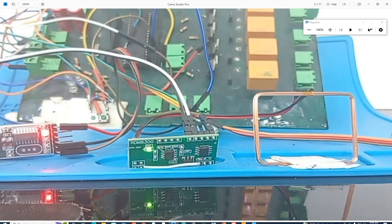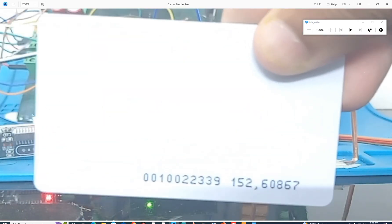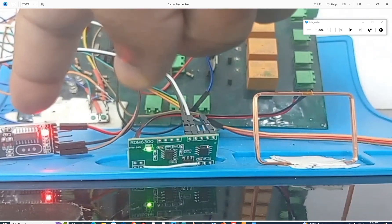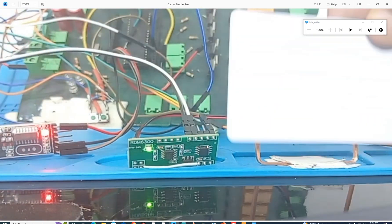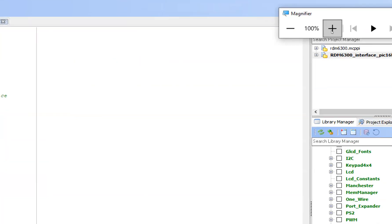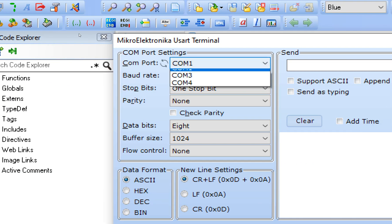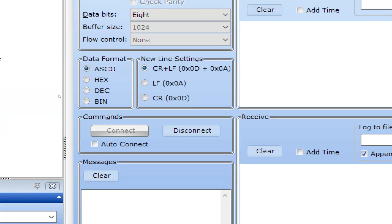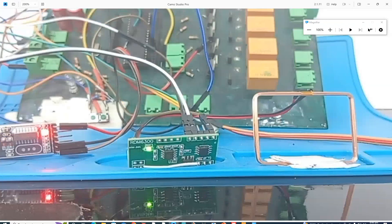I power up using the Pickit3 programmer tool. This is the card — I only have one. See the number on it: consider only the left number — 00 1 00 22 339. That is the number we have. I swap this card and see what happens. The USB2TTL device blue LED turns on, meaning data is being sent. Now let's go to the USART terminal and check what is being sent.